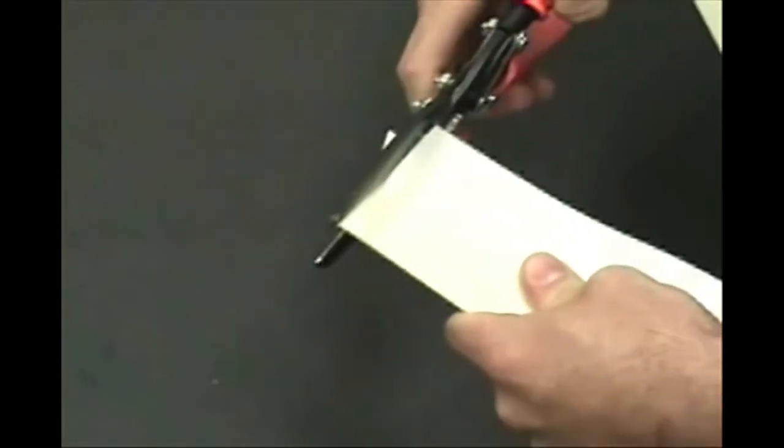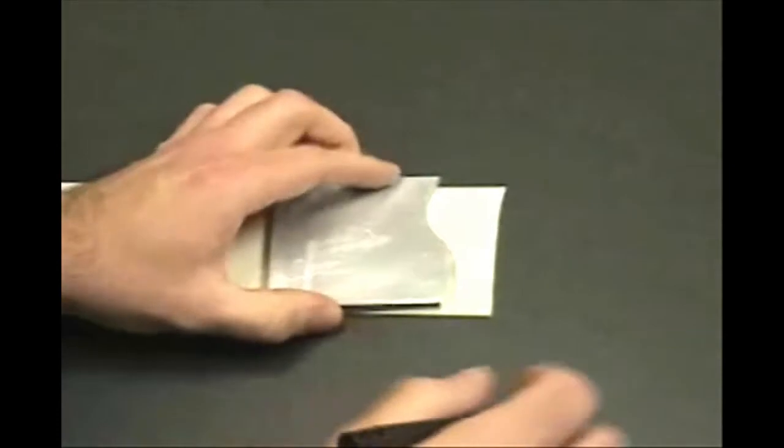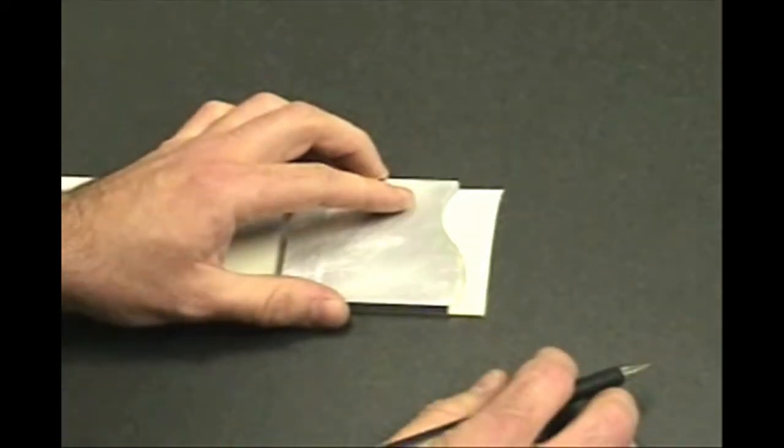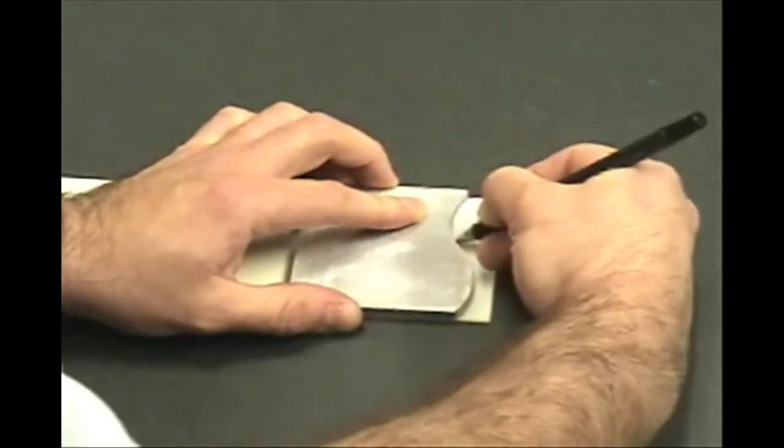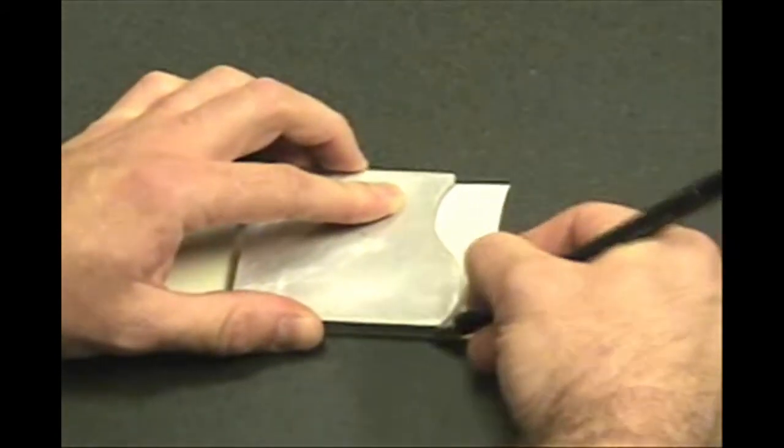Using a good quality pair of scissors, cut each end of the band square. On one of the cut ends, place the template on the top tapered side of the band and equally align the template with the end and sides of the band. Next, use a marker to trace the outline of the template onto the band. Now using good quality scissors, cut out the S-shaped splice outline.